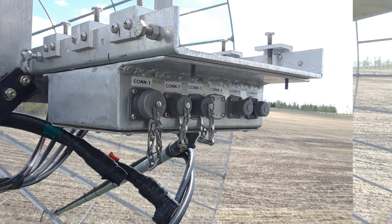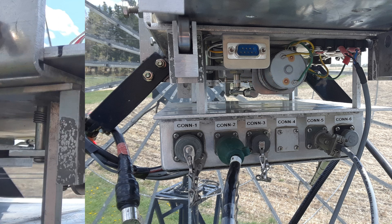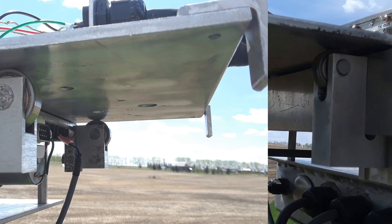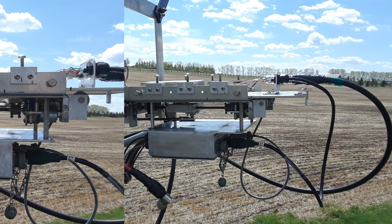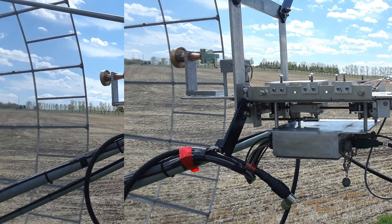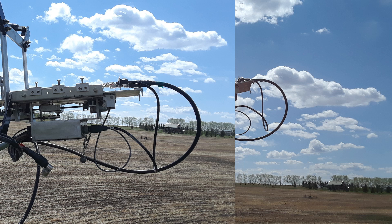The feed actuator has to go in between these two. It's not a big job — the interface box just has to unbolt and drop down, and then there are some spacers that go in there and the actuator is bolted up against the bottom of the feed tray. You can see the two rollers on the back that the feed assembly rolls on, and on the front as well, so it slides back and forth fairly nicely. The arm connects the actuator to the feed for moving it back and forth. The actuator is run by a small DC gear head motor which turns a threaded rod and pushes that arm back and forth, causing the feed to roll and the tray to adjust for focal point.